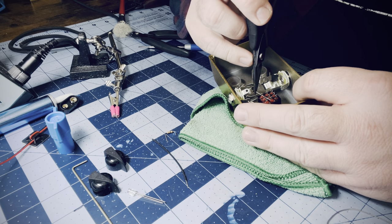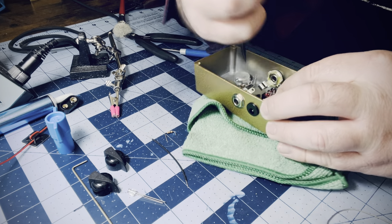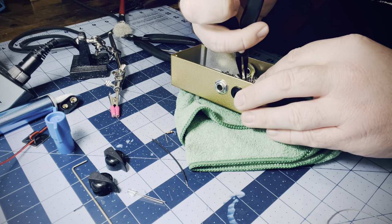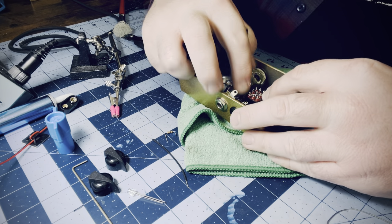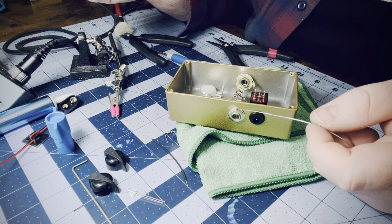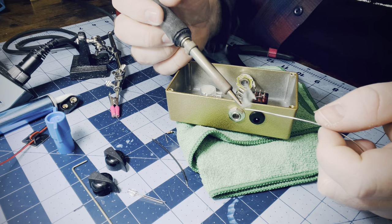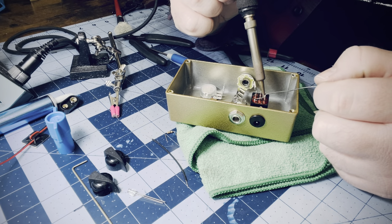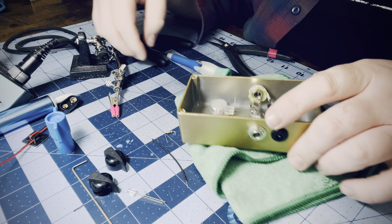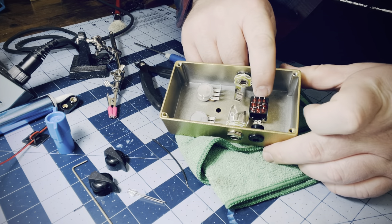This is going to go from the input lug to the circuit down here at an angle. I run the iron pretty hot — I think it's like 850 degrees — pretty hot iron. If you're pretty good at soldering and pretty fast, I think it works better and you get really good results. But you have to be pretty quick on foot switch lugs because this epoxy will melt really quickly.